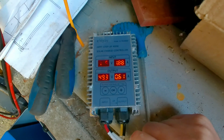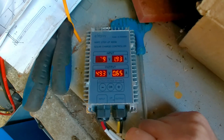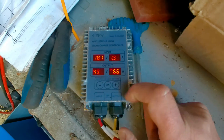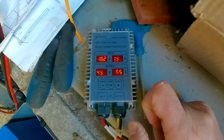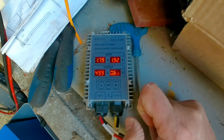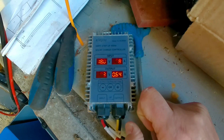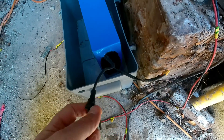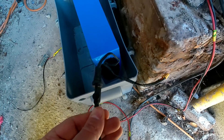We're getting about 2 amps in and outputting about half an amp. What we want to see is if it goes to 49.7, then we'll go to 49.9 and see how long that takes, and whether it stays at that or goes above 50. We don't want it sitting above 50. Also worth noting: this battery has a charging port, and the BMS should cut it off at 100% anyway, so it gives you a double safety margin.